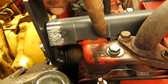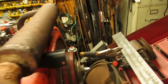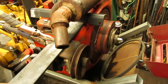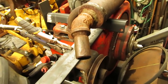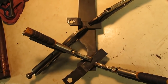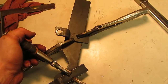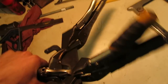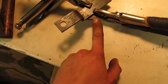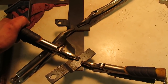I'll come off the side of the bracket with a piece that attaches to the intake manifold bolt to keep everything in line, and the hydraulic pump will be mounted on a bar that sticks out the side welded to the piece of angle iron. Here's the upright part of the bracket before welding — I pulled it off to get more vice grips onto it to hold everything in place. The brackets hang over the edge of the bar and will get trimmed once everything is fully welded. Now we'll take this to the bench and get everything tacked up for a dry fit.